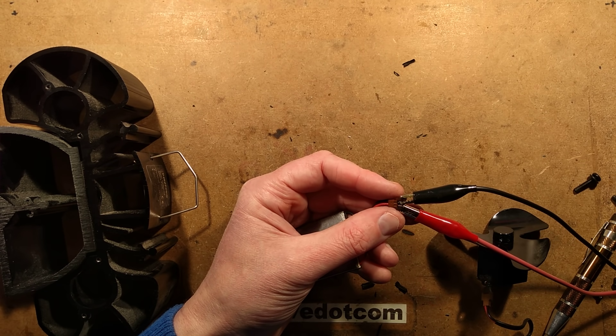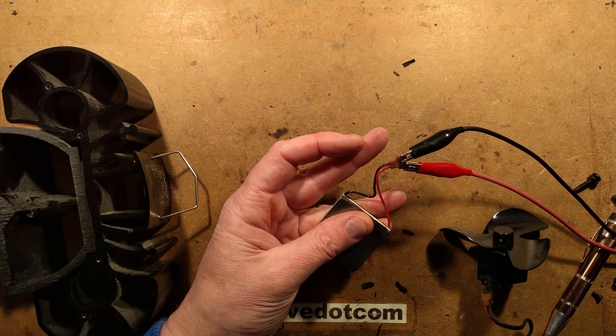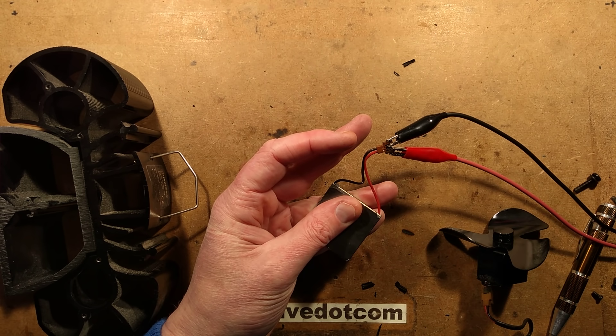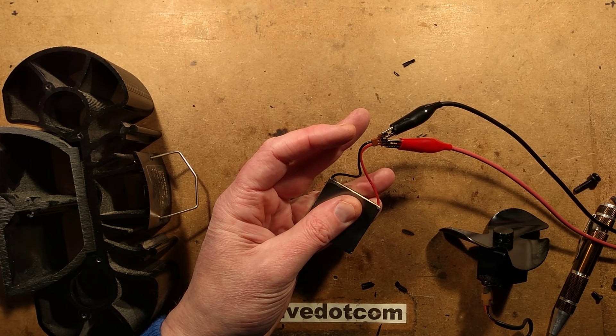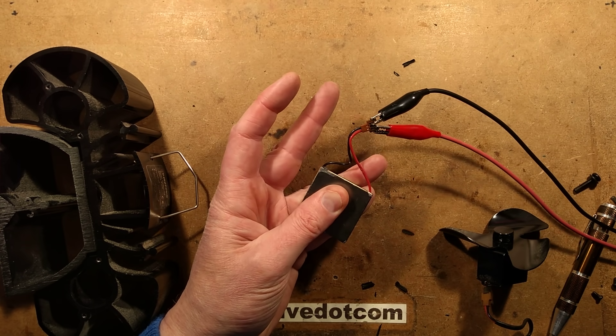It's drawing current. Let's turn the voltage up and see if one side gets warm and one gets cold, assuming they're not just shorted. The bottom side is getting very cold — noticeably. That's quite a sudden transition and the top is getting notably warm. That's running at just seven volts and about an amp. Let's turn it up to an amp. Eight volts draws about an amp and this bit does appear to be working.